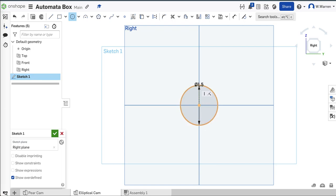I'm going to put a circle halfway between the center and the edge. It's 1.5 all the way across, so I'll put a circle down about here. I'll get my dimension tool, make it a 0.27 circle. I want it to be — if it's 1.5 in diameter, it's 0.75 in radius, and I want half the radius, so 0.375. The dimension tool: the distance is 0.75 divided by two, which is 0.375. Extrude it — quarter inch, 0.25.